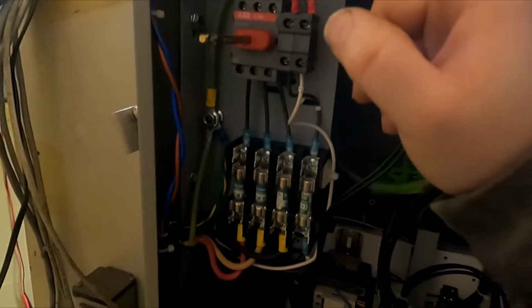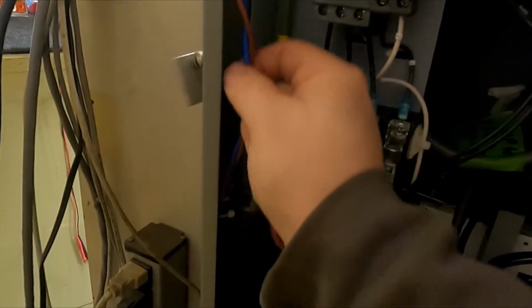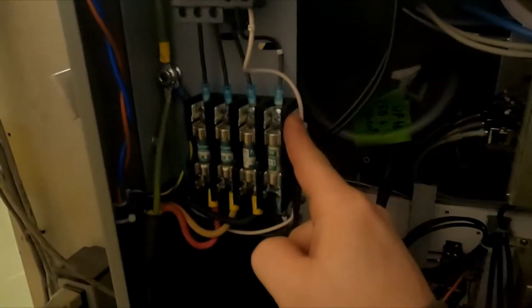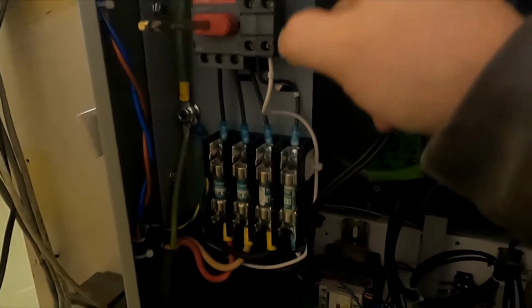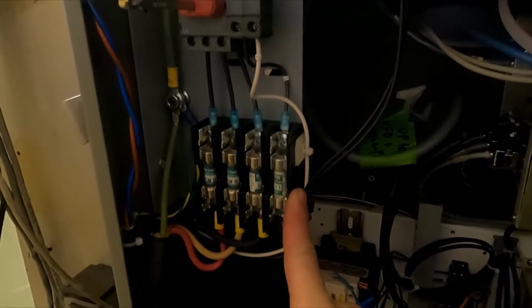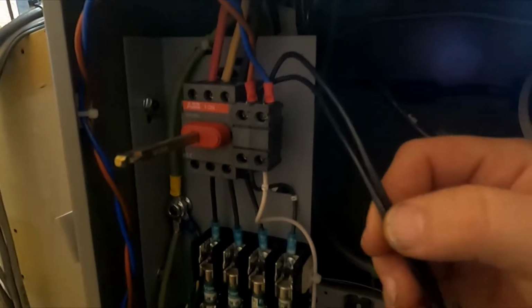On the other hand, the 120 volt input is this wire here, and this comes up and goes in this side of it, and then goes down here. So you've got the 120 volt going the opposite way of that. That's a problem because these 2 wires are for a 24 volt power supply for the solenoids for the tool changer, the release on that.